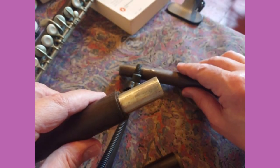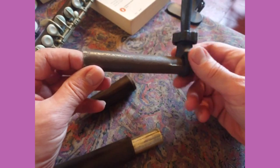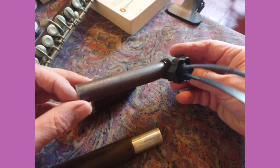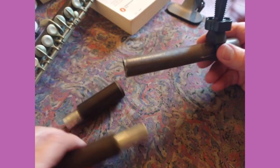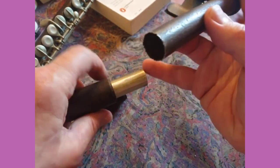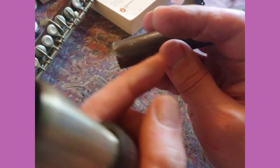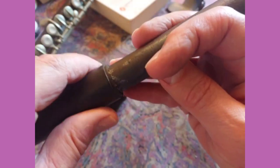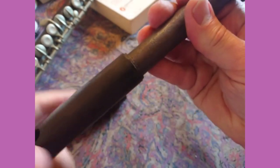So you have to clean it out somehow. I just recently made up this impromptu tool — it's a piece of mild steel tubing from an old broom handle. It was originally plastic-coated but got rather rusty when left outdoors. I cleaned the plastic coating off and the worst of the rust, and it just happens to be a loose fit — a bit bigger diameter than the liner tube of the head, so it fits over that. It's a loose fit, and I've cut with a file some crude saw teeth in the end of it. It slides over and fits inside there quite nicely, sitting more against the wood tube than the metal tube.